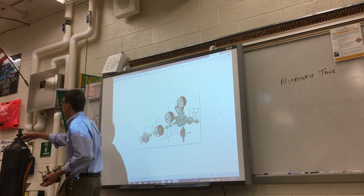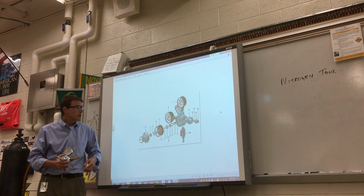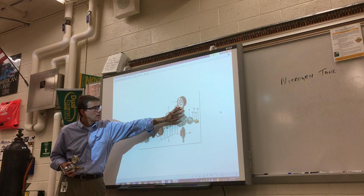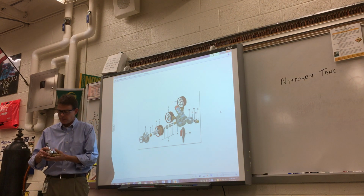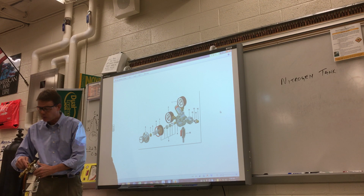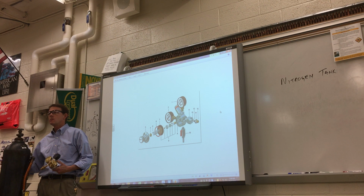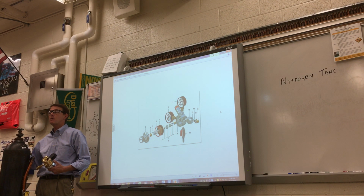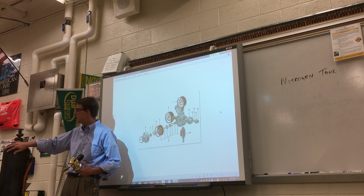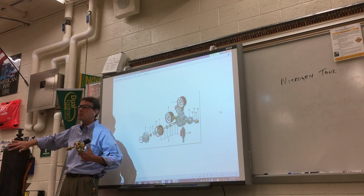All right, we're just going to go ahead and hook it right up because it's been used several times. And then you see these things over here? See that here? That's this piece right here. That's a pressure relief device down in there. All right, that's a pressure relief. That's in case this thing gets hot. What would happen if this thing warmed up really, really hot, like in a fire or something like that? What would happen to the pressure? There's a relationship between pressure and temperature. It would go up. And eventually, if it can't leak out, it'll blow up. Tank will act like a bomb then. Your water heater could be something like that.